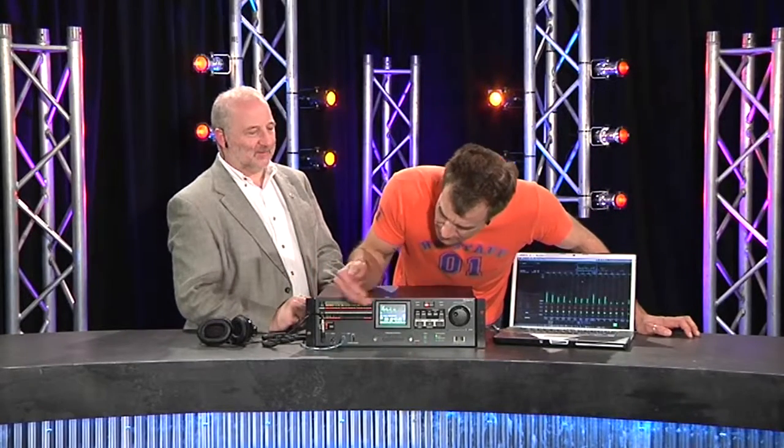As a recorder, how does it feel? It feels great. It's got really nice transport controls. When you press stop while you're recording, you can set it up so that you actually need to confirm it with a press of the on-screen display — this is a little touchscreen. The jog wheel feels exactly the same as the jog wheel on a real tape deck: shuttle, jog, stop, start — really easy to find. You can go and find any part of a track really, really easily. You can choose your hours, minutes, seconds, and frames, and just scroll the jog dial to index to that point — scroll to some number of minutes, scroll to some number of hours, and bang, you're there.